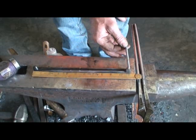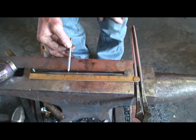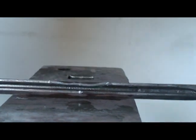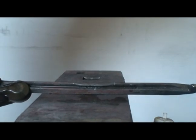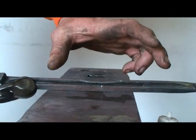To offset this shoe, we're going to go with ten and three quarters — halfway mark would be five and three-eighths — and then the beginning of our safing will be an inch and an eighth off of that on both sides. So just to save complications, we're going to safe it in the cold so I can be more precise. When I pull that, it will all pull tight and my toe band will already be sorted out. I'll put my toe nails behind that corner right there and my toe should pretty much be sorted out. All these hammer marks will be blended in by pulling that around the horn.